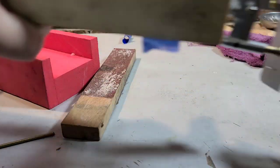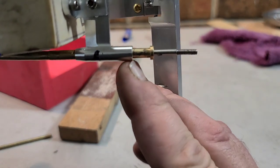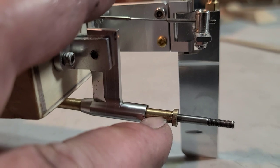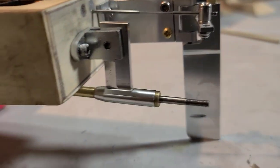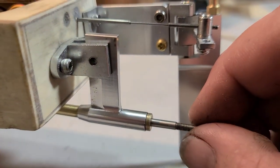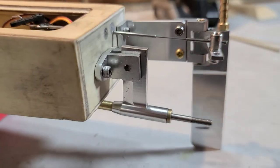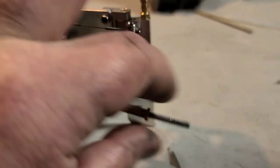So basically my next cut, I would cut exactly that much from the bushing to the strut. I measured it and cut that much off. And it fits perfect. Okay, it's bottomed out on my motor shaft right there. Got a little room for play, not much, just a little bit of room to play, so you don't bottom it out on the bushing or bottom it out up here. All right, so I actually rounded off my cable end.